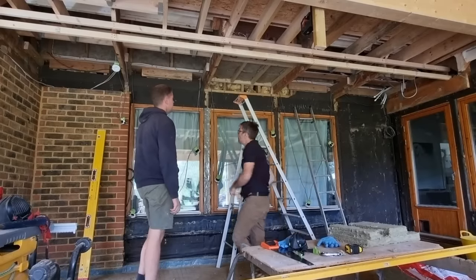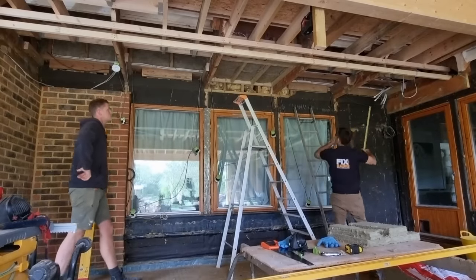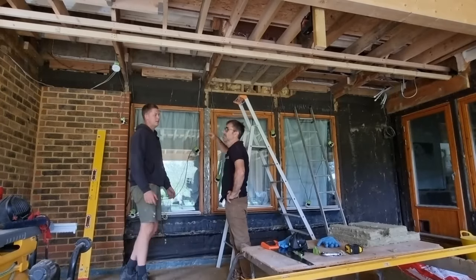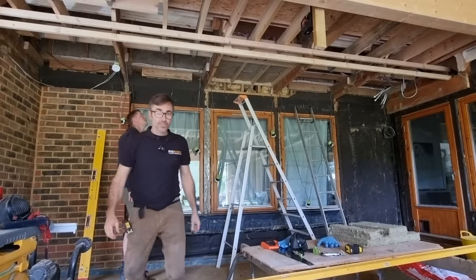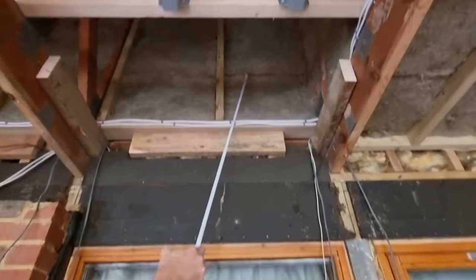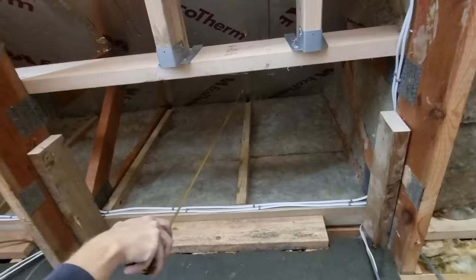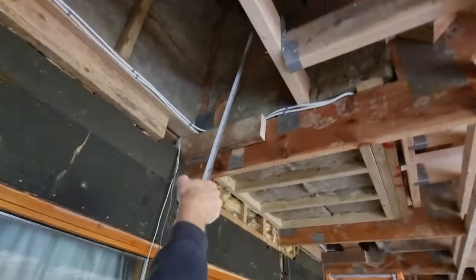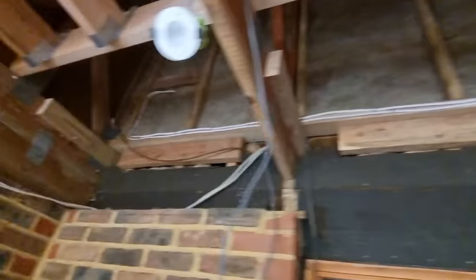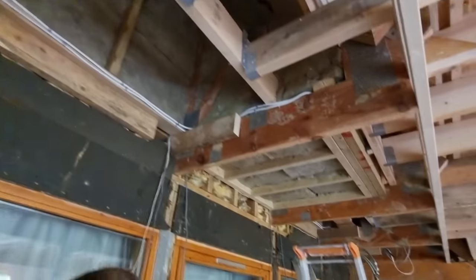It's done — we've got all of the back wall done. We've come around the side of the dormer, underneath the dormer, back up the other side, and all the way over, so we've basically covered it. It already feels like the sound is dampened here just standing and talking. It was a shiny flat surface before — all the sound was bouncing around. Now the soundproof insulation goes all the way to the top where the dwarf wall meets the rafters and the other insulation. The dormer and the floor are all insulated, and we've filled all the little cracks and added insulation behind the sockets too.